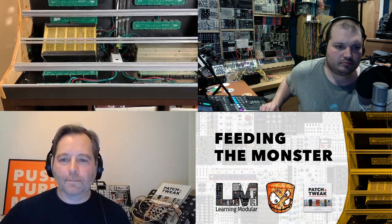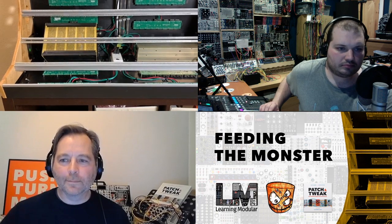I might as well put myself up on the camera while I'm talking here. So I do have an intention of eventually synchronizing the modular and the laptop. And there's a couple ways of doing that. There's these new CV tools inside Ableton, which is a way of sending a clock out. I probably would use Ableton as the clock master in that case, and have my different cases slave off of that. But I've encountered other Ableton users I've been recording with who don't have CV tools or don't have a proper interface that's DC coupled to use CV tools.